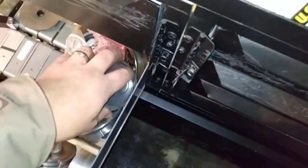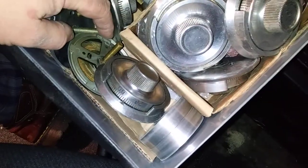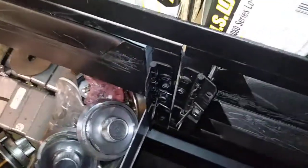I carry a lot of dials off of banks because they always want to upgrade to electronic locks. The only problem with these dials is they have a short shaft for the half-inch steel plate door, so they're not good for fire safes. But I've got a couple other dials on the van with a longer shaft, so I can use those same movements.